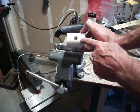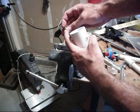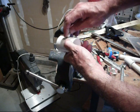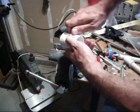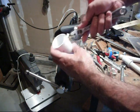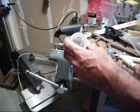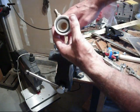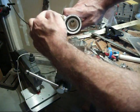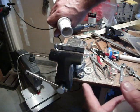What I did is drill a hole in the end of this larger fitting, sized so that a coupling — pipe fitting on one end and a tube fitting on the other, an NPT-to-tube coupling — fits in there snugly and makes its own threads as I turn it in. Get that started, crank it around with a wrench, put some Teflon tape or glue, and glue it in. Make sure it doesn't stick too far into the inside, because when assembled you don't want it to hit the outer coupling and block the air flow. The air comes in here, fills the area around the outside, and escapes through the drilled holes into the center tube, spiraling down to the end.